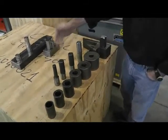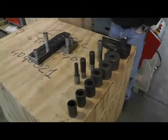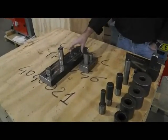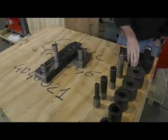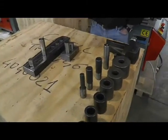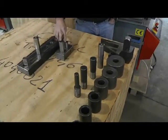These are the counter bending pins that come standard with the machine. Over here is an optional accessory — the bend arm extension. The bend arm extension is used when you have formers over the size of five and an eighth, with a maximum former OD size of up to 16 and five-eighths inches. These are your counter bending block, the bend arm extension, and the four pins that come with this tool.